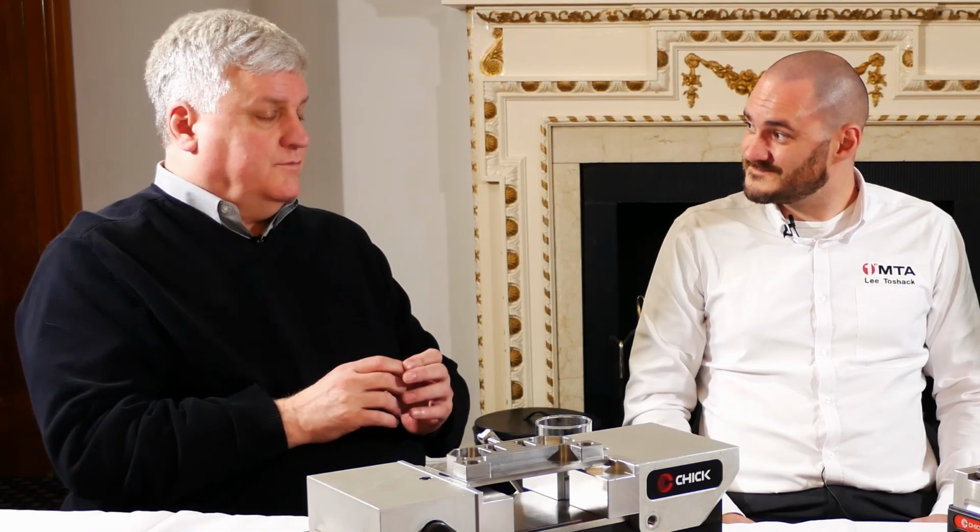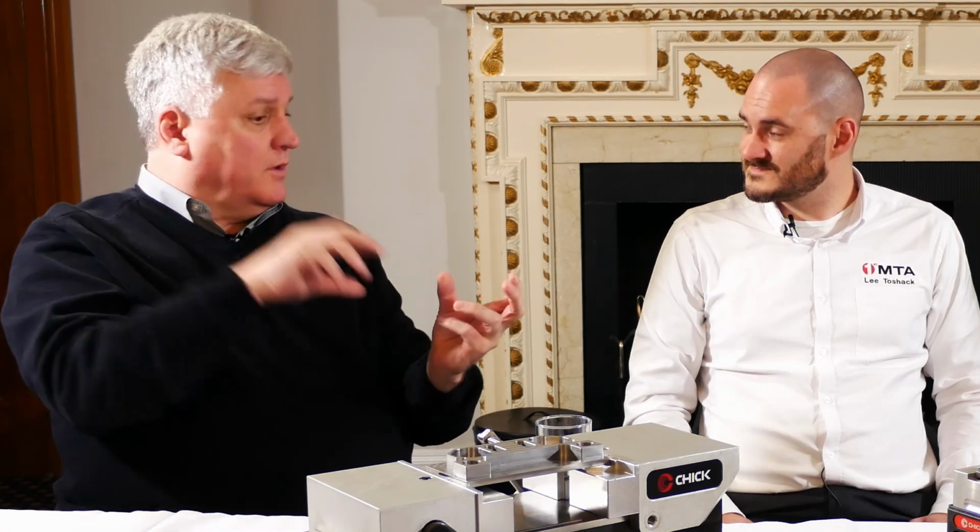Yep. Makes perfect sense. And the thing that a lot of times you'll see is that people are taking that same inefficiency we talked about at the very beginning and putting that in now. I've got five sides of the part. The advantage of the 5-axis is I'm putting in one part. Sometimes you get the code out of the CAD system and you run that one part. When that one part is run, all those tool changes are amortized over one part. The cycle time on that is going to be significantly longer than if you had 2 parts in a quick lock or 8 parts on a multi-lock. Okay. It makes perfect sense.